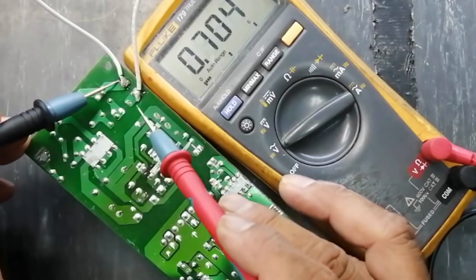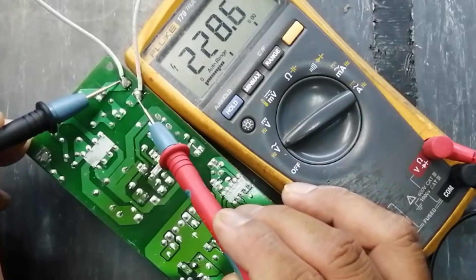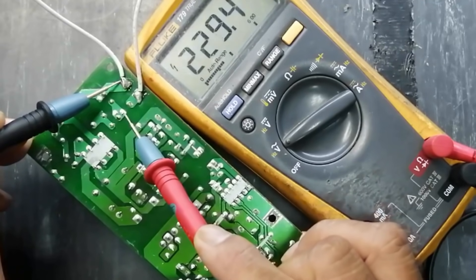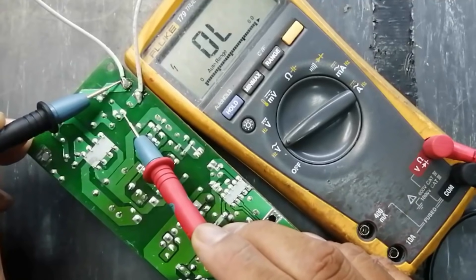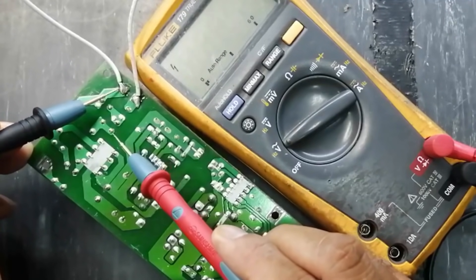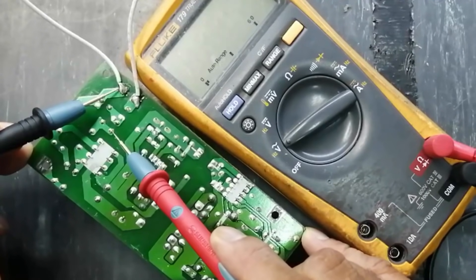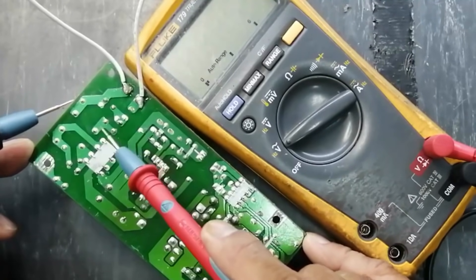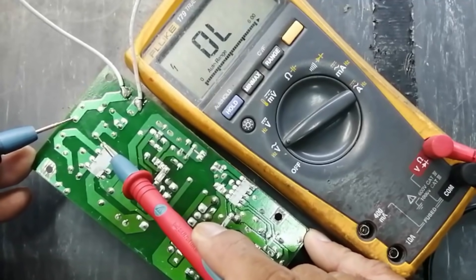At this point, I have 229 volts AC. Check outside and inside of the fuse — we have voltage at input and output side, so the fuse is working. Check the NTC input and output: we have voltage at both, so this component is good. Then this line is coming directly here and at this point we have voltage.